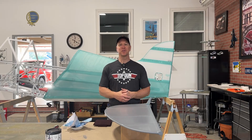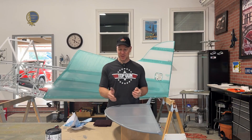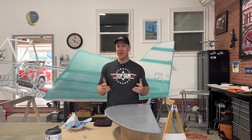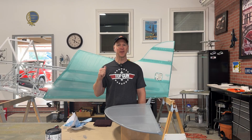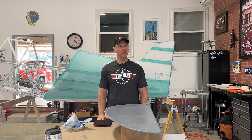You've seen from start to finish what's involved with covering an airplane with fabric — from prepping the frame, putting the fabric on, rib stitching, putting on all the tapes, sealing the fabric, and putting on the primer. The next step is to paint, obviously after I finish putting on all the coats of primer. Once this is done, I'll finish up the fuselage, get the EcoFill on there, and then everything will be ready for paint. My goal is to have this entire airplane — minus the wings, so basically the tail pieces and the fuselage — painted by the end of summer.